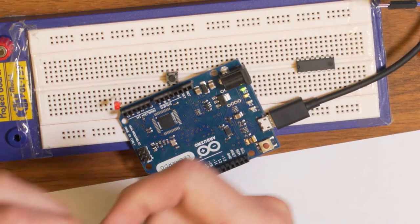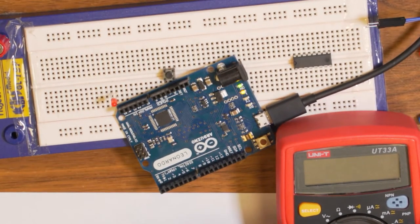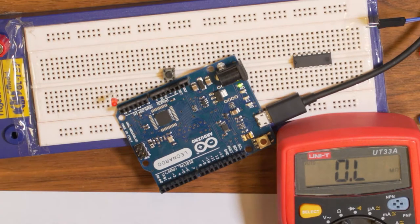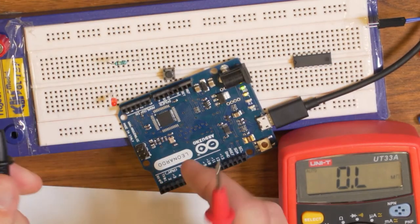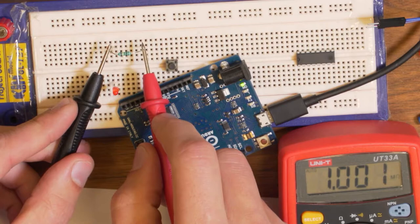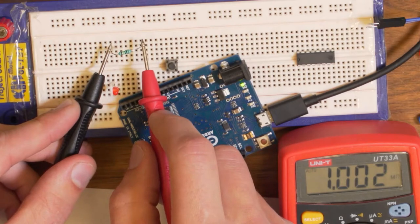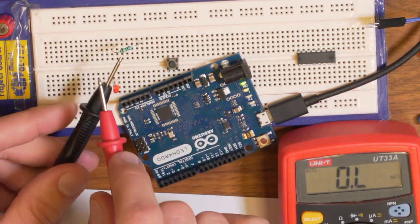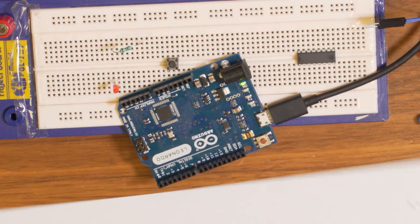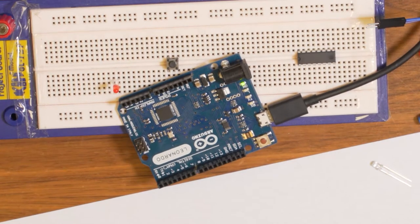Much easier is to just take the multimeter and tell it to measure resistance. For simplicity, I will put this resistor here and measure the resistance over the resistor. I hold it and I see, okay, 1 mega ohm, because there's a one with a dot and a small m on the side, which tells me it's a mega ohm. So then I know it's a 1 mega ohm resistor. Then I don't have to interpret all these lines, because that's time consuming and disturbing. So that's one advice also for you.